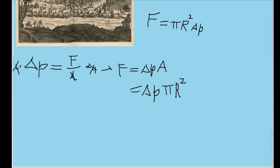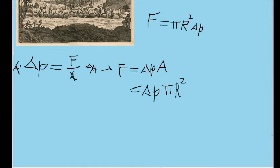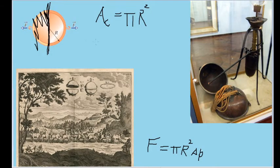This represents the force due to pressure acting on the cross-sectional area of the sphere parallel to the horizontal axis in which we're pulling, but acting in the opposite direction. However, this method is not very rigorous. While it works, most professors might not be satisfied because it oversimplifies the geometry of the sphere without rigorously proving that the pressure acting on the sphere equals the pressure on the cross-sectional area. To prove this more thoroughly, we'll have to use some calculus.